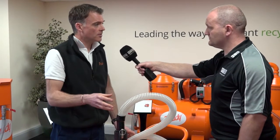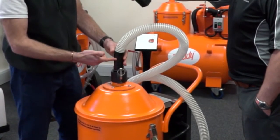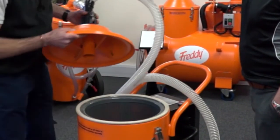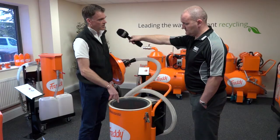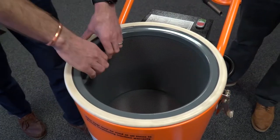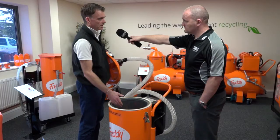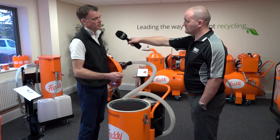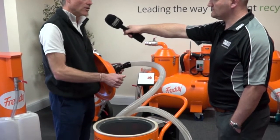At the CNC or wherever the customer has the liquid they want to pick up, you switch this on as a vacuum. The liquid travels up through the hose — in this case 38mm, though you can go larger for big curly swarf — down through here into the filter bag, which ranges from 1 micron to 1000 micron. The customer decides what they want. Some bags are disposable and some are reusable. It's held in the filter basket, easy to lift out, tip into the swarf bin, and the clean liquid is left underneath.